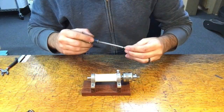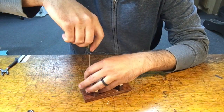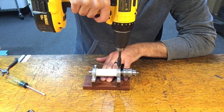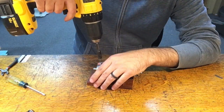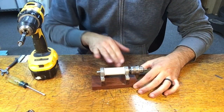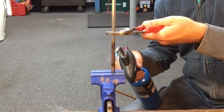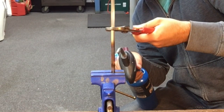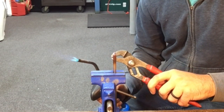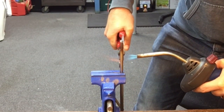I'll now spend a little bit of time making sure everything lines up perfectly. Traditionally, the foret is driven by a fencing foil and some cord. The foil can be heated up with a propane torch in a small area and easily bent with some pliers. I take care to keep everything aligned and not to heat too large of an area, as this will remove some spring from the foil.